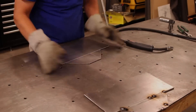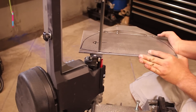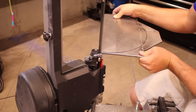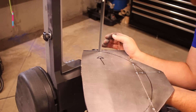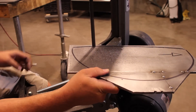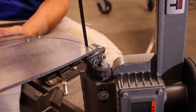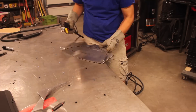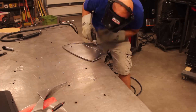I'm fairly worried about the newel post at the bottom of the stairs being knocked loose in the years to come after I've gone to all this effort to install it. So I'm going to use some quarter-inch steel plate — just some scraps that I had — to build a bracket that will let me bolt the post to the concrete. I started cutting it out on the bandsaw, but when I broke my first blade and then threw my last blade, I thought to myself: why aren't you using your plasma cutter? I actually had never used the plasma cutter before — it was just sitting on the cart. So I made the remaining cuts freehand with the plasma and it was incredible.